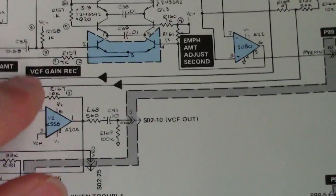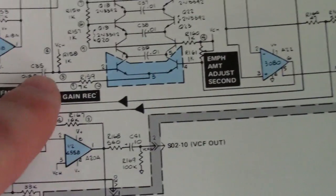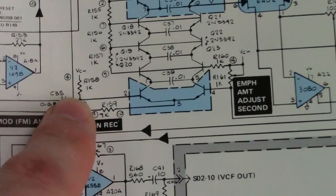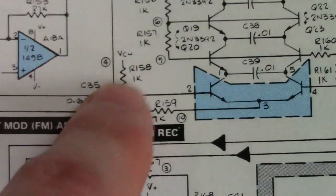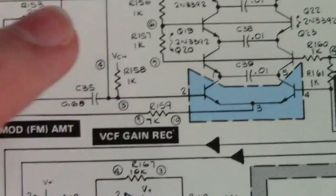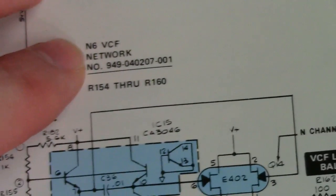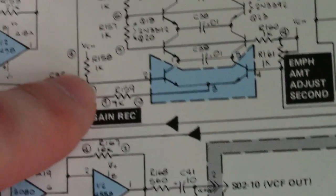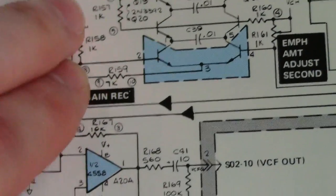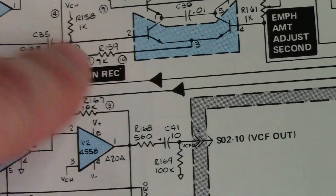That evidently did not work too well because I think it pulled too much current for all the ladders and everything in this filter. Once I replaced the E402, I got looking and I noticed that resistor R158 had opened up. This is in a resistor network — one of those little resistor networks. It's N6, and it was reading nothing from pins three to four in the network. So that was one of your issues.